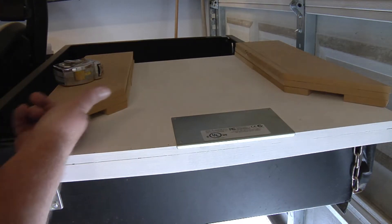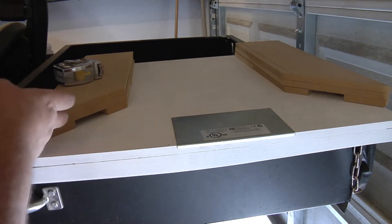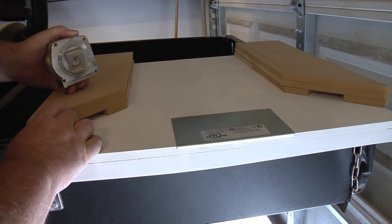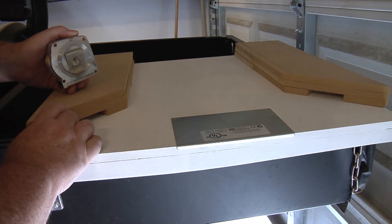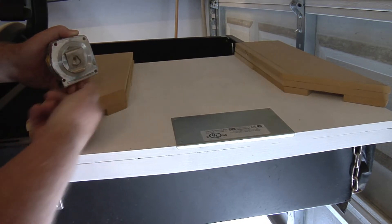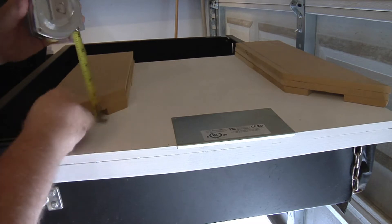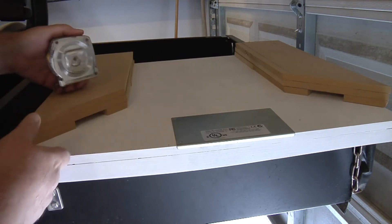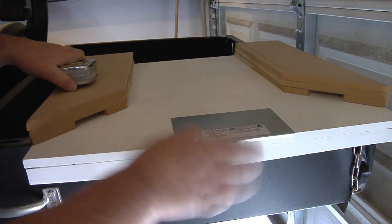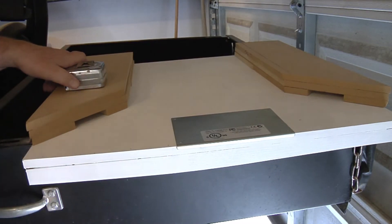This is just three half-inch pieces — I built this out of half-inch material, three pieces, inch and a half tall. So you couldn't do three pieces of three-quarter — you'd have to do two pieces and something else thinner, and sandwich that in between. Because you still need at least a half inch here for your house. Anything that goes in here goes to the house. Let's go over to the machine and I'll show you what I'm doing there.